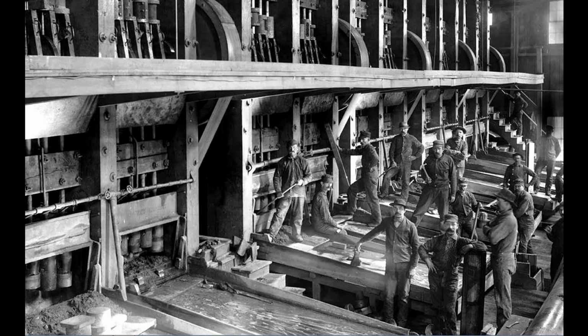Okay. So today we looked at stamp mills and basically the concept of crushing rock and extracting the gold and silver out of it. Now there are hard rock mines with gold all over the western US and indeed all over the world. These stamp mills were used, there were thousands and thousands of them back in the day. Later on they were replaced by ball mills, which we'll talk about one of these days. It's a different process, but it's more energy efficient. But the idea is there were easy ways of crushing rock, and then they recovered the gold by various methods.